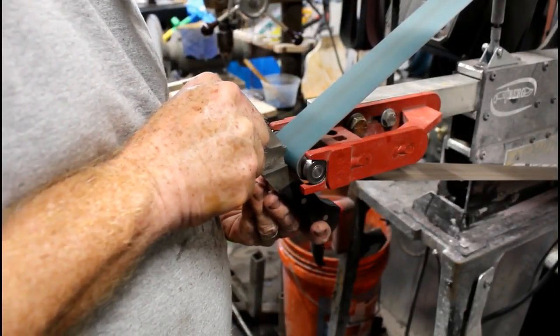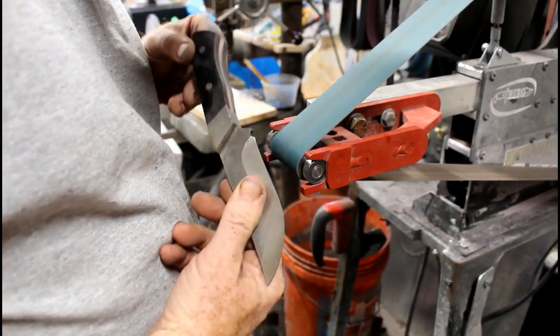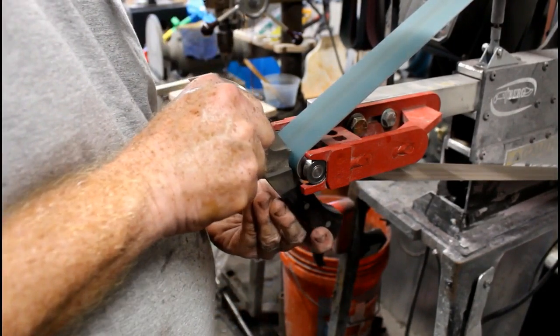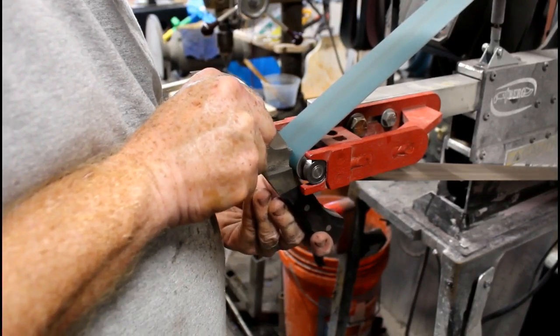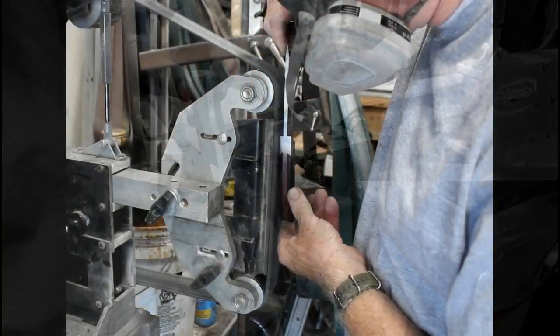This is using a small wheel attachment. This is also an OBM small wheel attachment. Always remember to just slow down the RPMs a little bit just to save the bearings. But this attachment saves a tremendous amount of time. I used to do that with a Dremel grinder, and it just took forever.